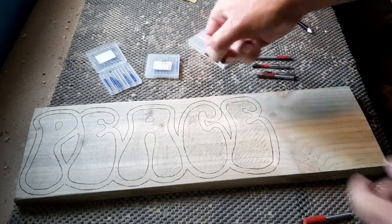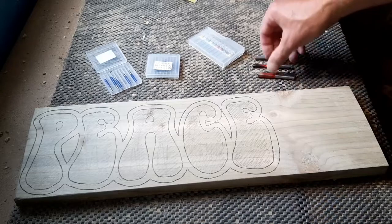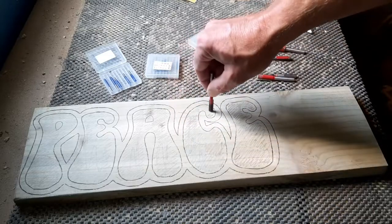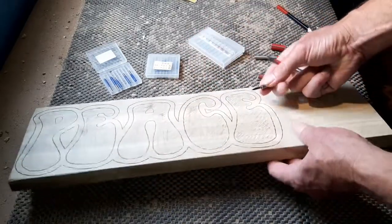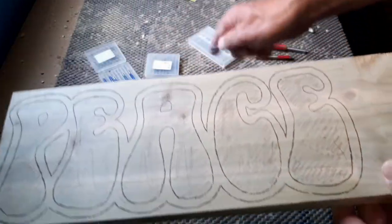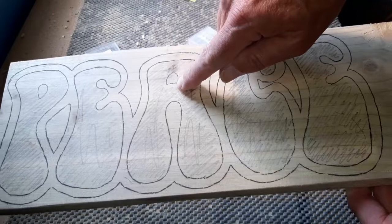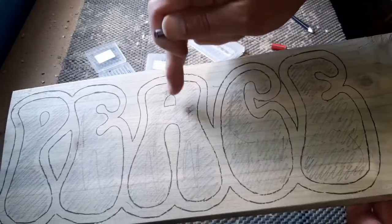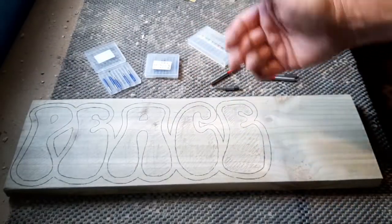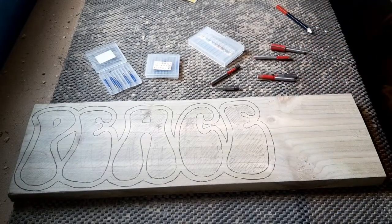Okay, let's pop our CNC bit in. We'll route out the letters first, and then we'll throw in one of these straight flush bits. Nice double-sided blade on that one, so that won't take too long. You will see how quick that will whip that out. And because we've done our lines first, remember, we've made a nice separation between that side and that side and round there. So as we come up with our larger router bit to that line there, because it's already routed out, that will pop off no problem, leaving those little bits nicely intact. Once we've taken all that out, like I say, we will tidy it up, and then we'll get a scroll saw and literally cut it out. We'll talk about the blade on the scroll saw later.